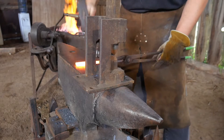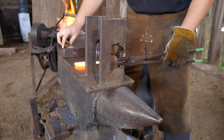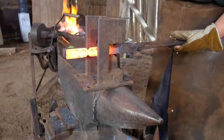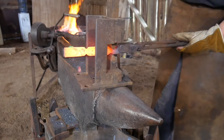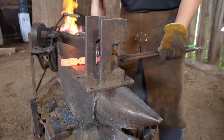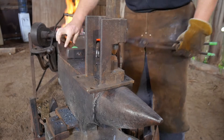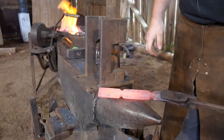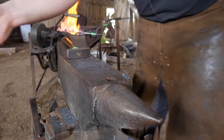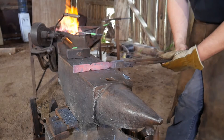We're going to drive down about half the material thickness of the parent bar stock, and we're going to put down our second shoulder as well. Because we're here we can just straighten this out on the anvil with just a few hammer blows to get it set up more properly. Now we can get rid of this tool altogether - it is not needed and we're ready for the next step.